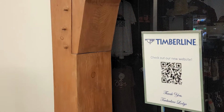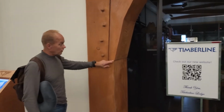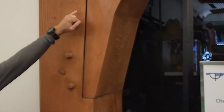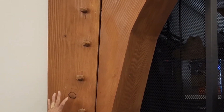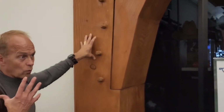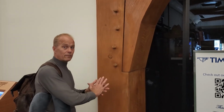They're staying straight. And one thing here, zoom in here, look at the little bit of shrinkage here. And then also you'll see some pitch. This is coming out. If these posts were in hot, direct sunlight, there would be more pitch. As the wood heats up, more pitch comes out, but then if the wood never hits that temperature again, less pitch comes out.